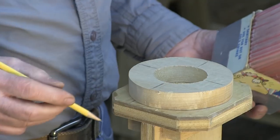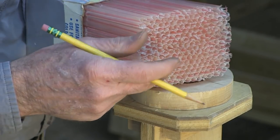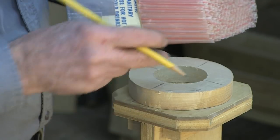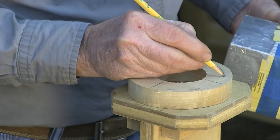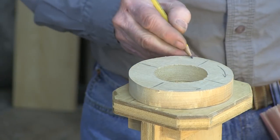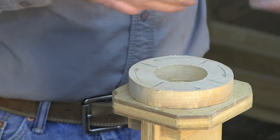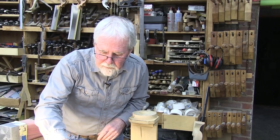If the box of straws is running through the piece in this direction — if I carve in this direction I'm going to be laying those straws down, so I need to carve in that direction for the outside. On this quadrant over here it gets flipped, so I'm carving in this direction. Then it flips again and the direction of cut is in this direction. So flipping in this direction means I'm going with the grain on each one of those quadrants. Let's try a number 5/20 gouge here.